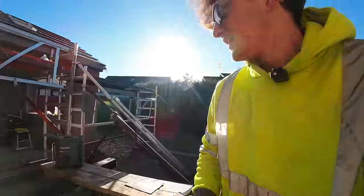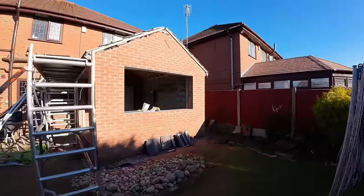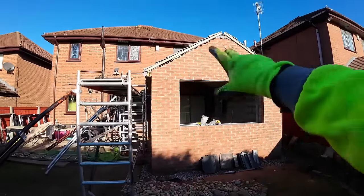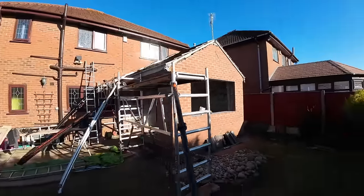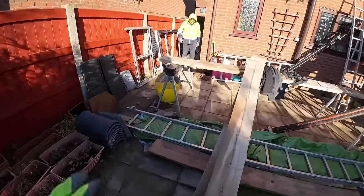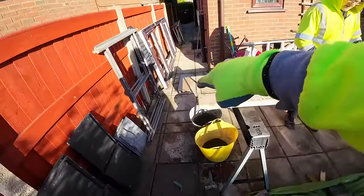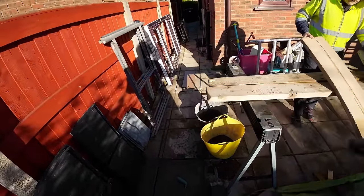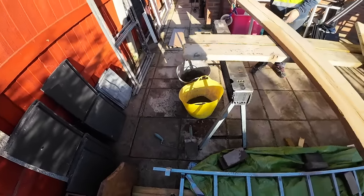Okay. I don't know how many days it's been since we've been here last, but I can finally show you. Now that it's all done, all the snagging's been done, all the gaps have been filled in, roof's obviously looking very nice, that Neil and Louis are getting done. And then obviously we've just been doing the flags while Dad's been picking up our stuff. There's one more cracked one here, and then I've reset those two because they were wobbling. And I'm just compacting up with some grit sand and cement. Just to compact it up.